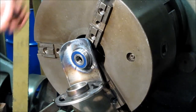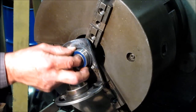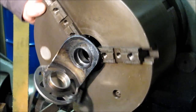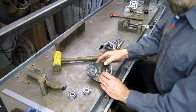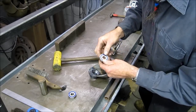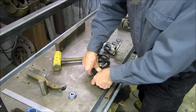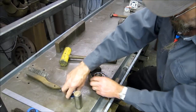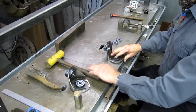That's just starting in there — I like that. We're going to leave that one alone. I just barely touched off the backside there and I did kiss that new material, so I'm going to leave that one exactly the way it is. We went ahead and we skimmed both of these bores here and we're going to put the bearings in — I'm going to push them in with the arbor press.